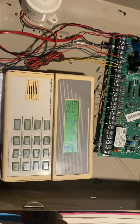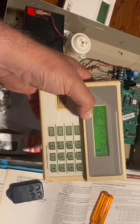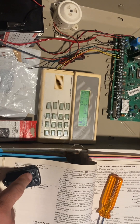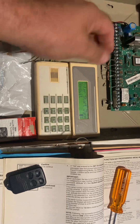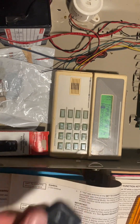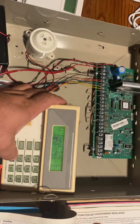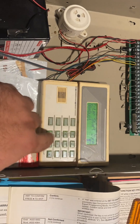Partition 1 — you don't need to change that. The panel has zones 49 through 64 predefined for key fobs, and this expert mode finds the highest group of four zones not being used and picks them for us. It's going to ask, do we want to start at zone 61? That programs this key fob at zones 61, 62, 63, and 64. If those were already in use, it would pick the next lowest four — it sources this out automatically. We'll start at 61. You can either enter the serial number, or if you don't know it, just transmit any button on the fob. It picked it up — there's our serial number. We transmitted loop 1, so that checks out. Done. That key fob is enrolled in, all four buttons in one shot.